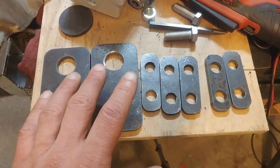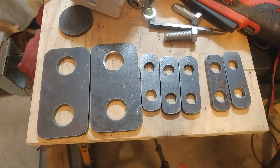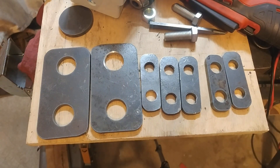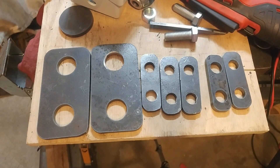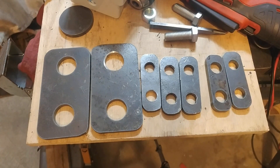The designs here were done in FreeCAD, and the G-code for these ones was made in FreeCAD, while I used Inkscape to make the G-code for these two. Sometime in the next two to four weeks I'll try to put out tutorials on both, and how to make these parts and the G-code for a plasma in those programs. Stuff like that for plasma cutters is surprisingly not covered well on YouTube — especially FreeCAD because the Path workbench there is rather new, and with Inkscape because people use it to sketch stuff and then take it over to Sheetcam to do the G-code, whereas you can just do it in Inkscape if you know what you're doing.